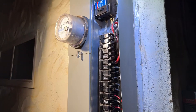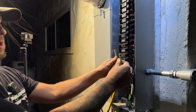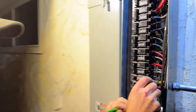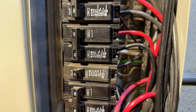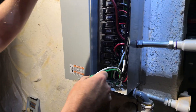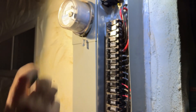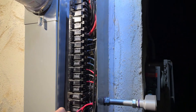My wife's inside with no power so we're going to try to do this fast. We have our ground wire and our neutral wire - those are both going to go to this bus bar right here in the back. If you have a separate bus bar for neutrals and separate for ground, white is your neutral and green is your ground - hook them up to the correct bar. Mine's all on one bar. My power wires - red and black - are going to go up to my back-fed breaker. We're working with some pretty big wires so we're going to have to wrestle these in here.